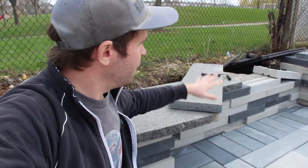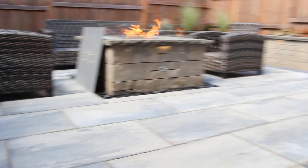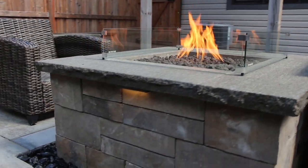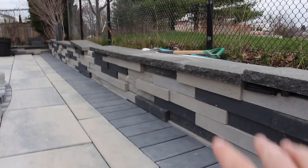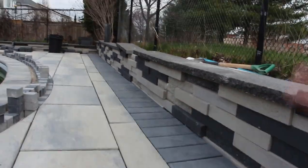The marettes are actually silicone-filled, so you can see the silicone oozing out of them — that's perfect. Positioning is super important with these lights. When you only have one light between two pillars, it's an easy calculation to center that light. I do like working in odd numbers as opposed to even numbers. You don't want too many hot spots — that's two lights shining in close proximity to one another. Outdoor lighting is about concealing the actual light fixture so it's not shining in your eyes, eliminating hot spots, and ensuring you're working with shadows, because shadows add to the texture of your entire surface.